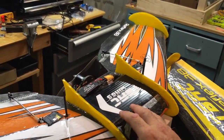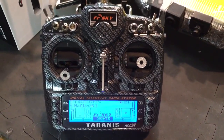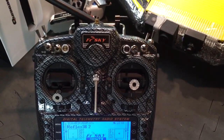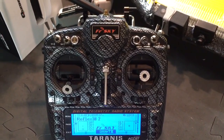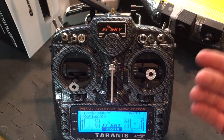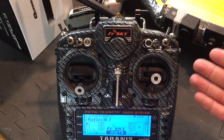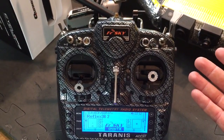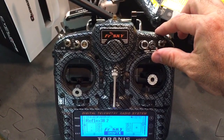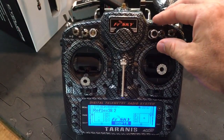She's plugged in and ready to go. The voltage setup works awesome. I have it set up on this switch here — if I move it down, it says '98 dB, 15.2 volts.' So it's telling me the RSSI on the first call and then the voltage on the second call, and it repeats every 20 seconds. It's a nice feature during flights so you don't have to have an OSD or guess your times. It's currently 15.2 volts since it's not charged up yet.